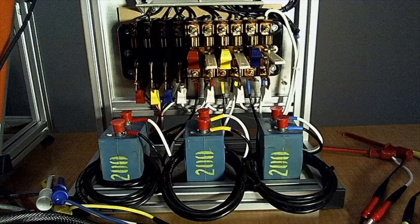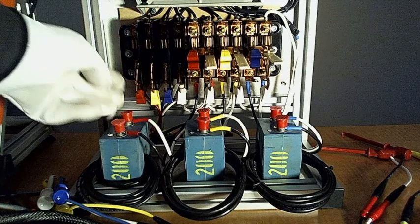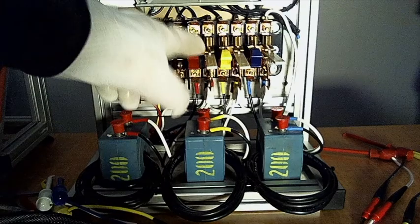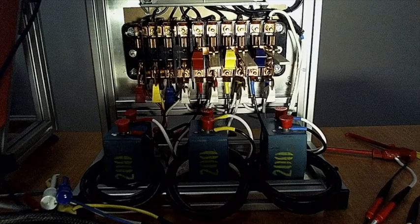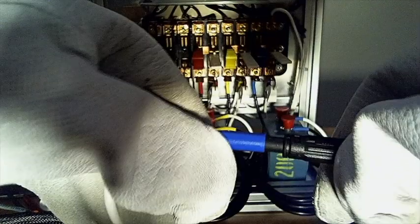So with this adapter, that's what we've done. As you see, we've got all of our voltages open. The shunts, the currents, the returns, everything is open. We've put these in as isolators so nothing can be backfed through. One great thing about it is we're going to be using these little 6mm cables that you can unhook.